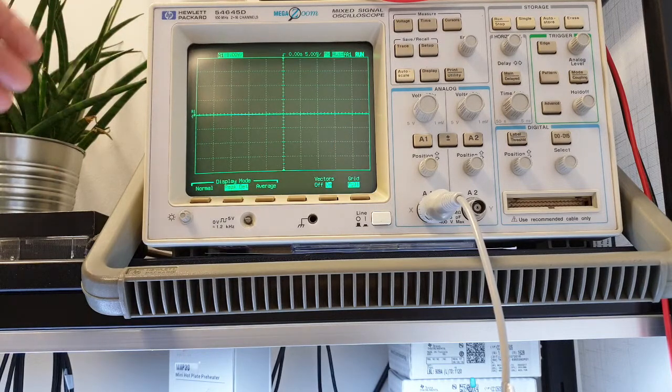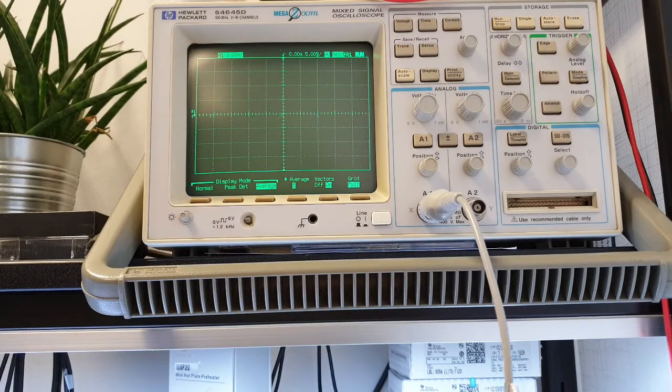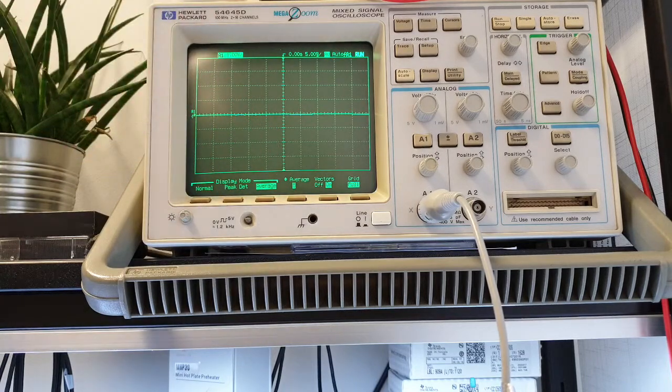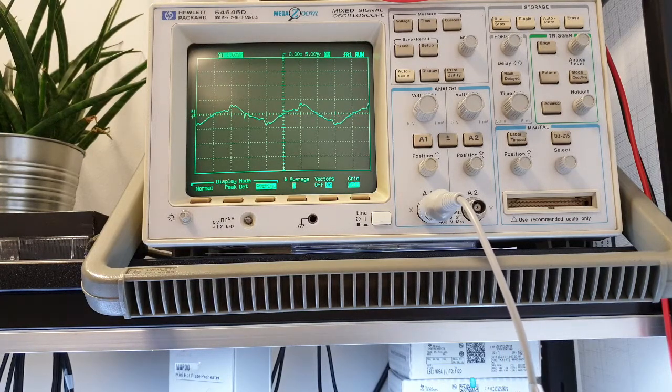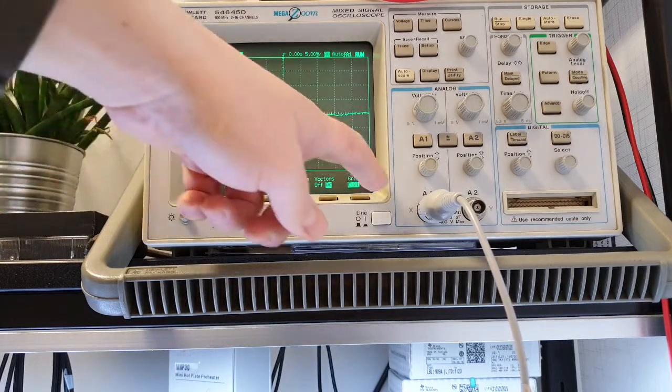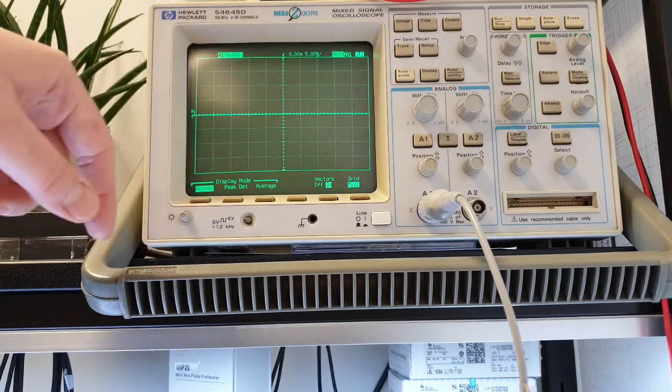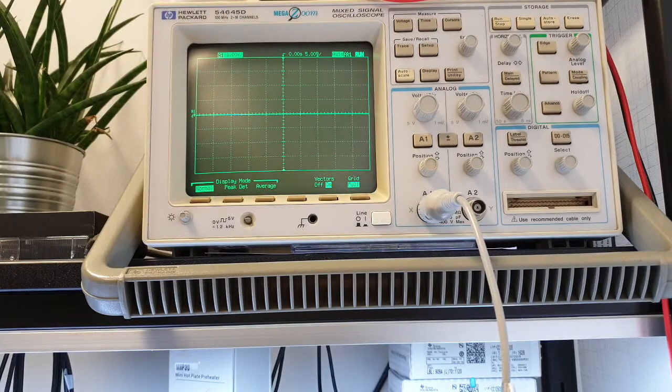The opposite of peak detection mode is the average mode, which could be turned on here, and we can define the number of measurements, the number of scans to average. And now when I'm touching the probe, it will rise slowly. It averages the signal from many measurements, which allows us, for example, to deal with very noisy signals. So you can do this in average mode. Of course, you can turn on or off every other bit here in this menu. So this is the display button.